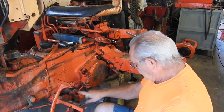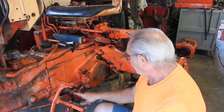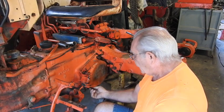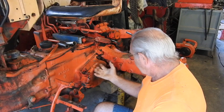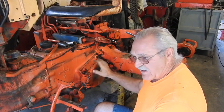It looks like it's fairly simple. There's the linkage down here — you have to take the cap nuts off, the lock nut, and everything. I've got those removed. I've got all of these loosened except for one Allen head, a 3/8 Allen head down at the bottom — a stud. I'm going to go ahead and pop that off. We're going to see if we can tap and beat on this, jostle it loose, and get that pulled off and expose whatever is under there.